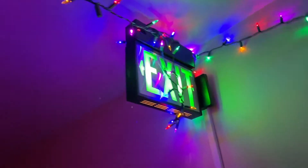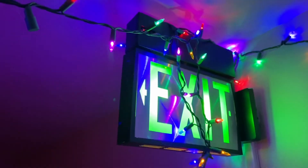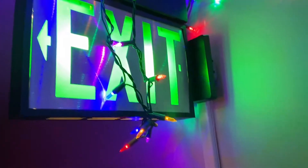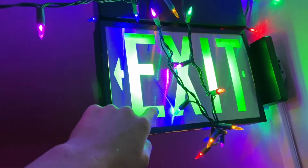In the first spot here in the basement I have the Light Alarms X Series Incandescent Exit Sign. This was new in box and it is side mounted on the octagon box. I did want to side mount this because I wanted a red and a green exit sign — technically this is a green one but we don't talk about that. I was a little concerned the sign might fall off but it is anchored in well. Usually I'd prefer to get into a stud but I couldn't find one at a reasonable distance, so it's just on anchors. You can see this one has a battery pack and a green faceplate. It actually came red but you can just put a green faceplate on these because it's an incandescent sign, so it doesn't really matter.